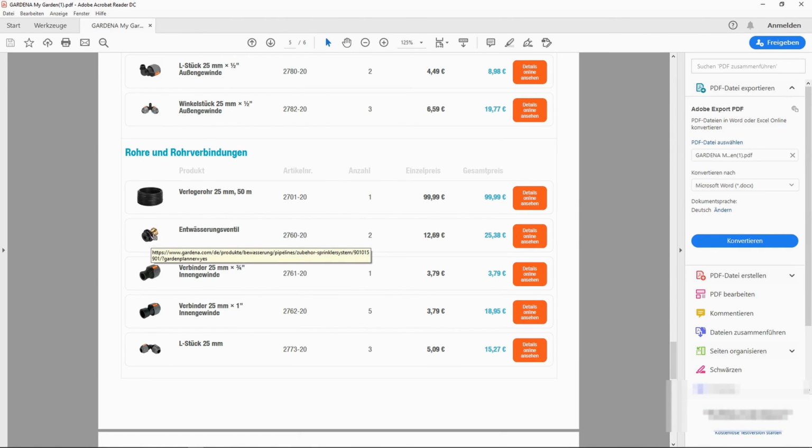I recommend that you install the irrigation system so that you can drain it with compressed air accordingly. Simply remove the snippet piece to connect the compressor directly to the lines, and then in the fall, attach a compressor and blow it out for about 10 minutes. Then the pipes are also freed from water. For this I have made many videos, which you can find below in the description or in the playlist. So that would be one point.